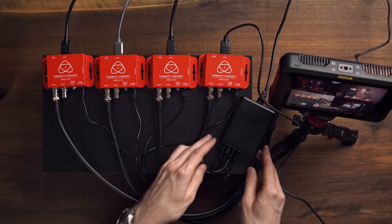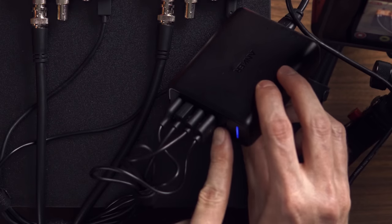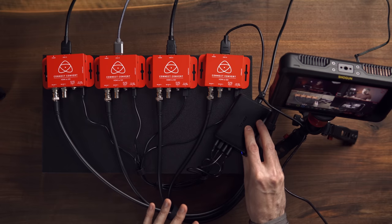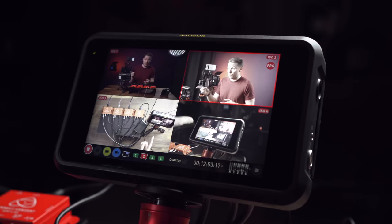The way that I have it set up is I'm using four micro-USB ports connected over to my Anker. It doesn't come with the USB cables, just the DC cable, so I connected them all using random micro-B cables into this Anker 5-port USB charger. Big fan of this thing — it's got four USB-A ports and one USB Type-C with power delivery. Then we just run an SDI cable from each of their outputs to the inputs on the Shogun.